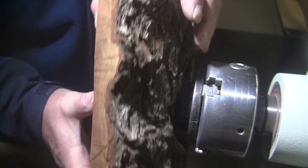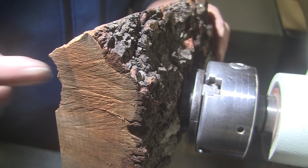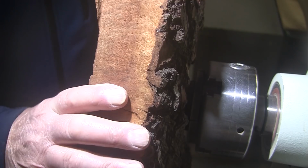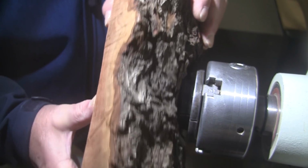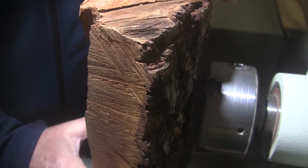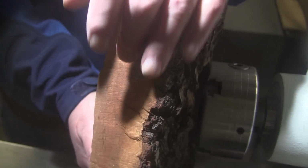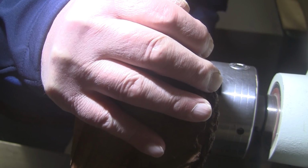I've stressed this before because people have trouble with woodworm screws. I'm applying a lot of pressure that direction as I screw it on. If you don't apply that pressure, you'll just strip out the hole. And you only need to do it about halfway on, something like that. Now I can just go ahead and screw it on. I think I'm just going to make it.